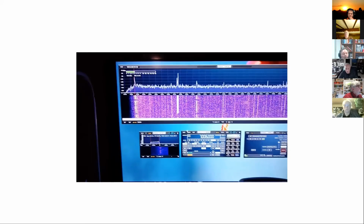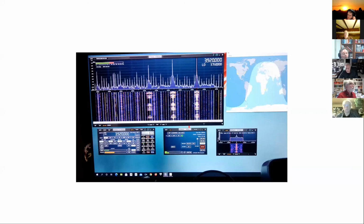Well, I have a couple of comments there. Okay. So this looks, there's a couple things. First of all, when I saw the pattern, it looked like some kind of a switching transformer. I know I have a battery charger that uses a switching regulator that will create this pattern. But being that you say that it sounds more like a mixing problem with other AM broadcast stations, I would expect it to change the amplitude at nighttime, because they end up reducing their transmit power. The typical thing that happens on that is that it is some kind of a ground, metal ground